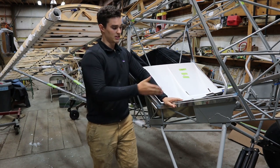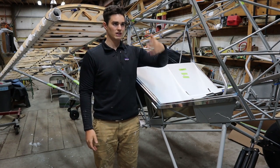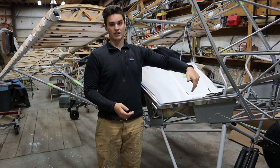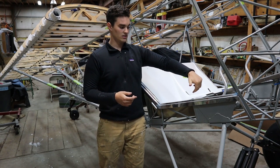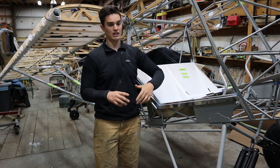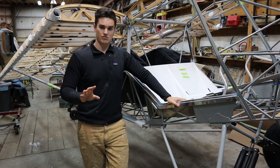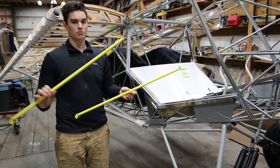What I actually wanted was the ability to crack the door for airflow, since I was going to add eyeball vents. But this plane has really easy-to-open doors and I can get airflow that way as long as I can crack it. The way to do that is with the standard hinge and latch — you notch the actual tab so that it has a second position. So it's a custom option but it isn't any fancy add-on — it's just the standard latch with a notch.